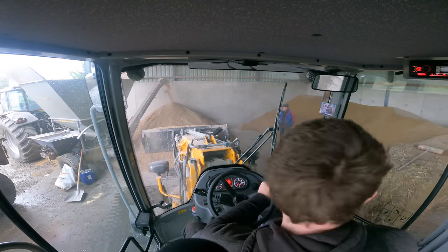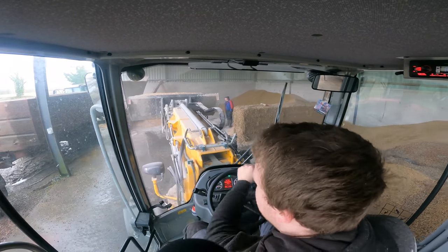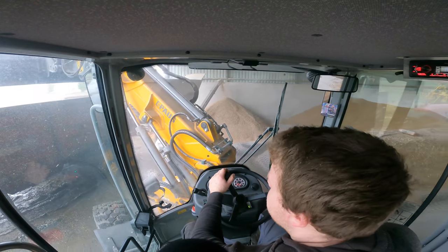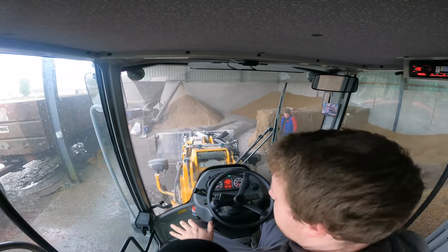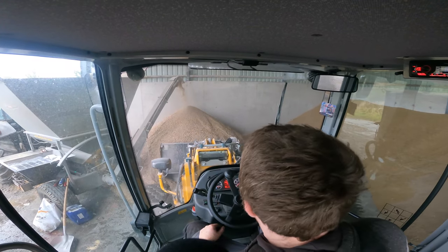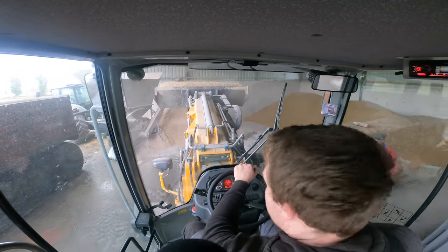The video has yet to come up, won't be up for a while yet, but I was testing out with a bale of silage what the extension was to the side. The bale's about 700 kilos, and at full tilt, fully out to the side and boom fully out, it was at 90%, and any little movement of the loader at all and you could nearly feel the wheels coming off the ground, and that was the limit. You'll see it in the video of when we're doing bales. We had bales to deliver that we'd sown, so we went at it with this and the tongs on it, or the soft hands. But that was the limit.